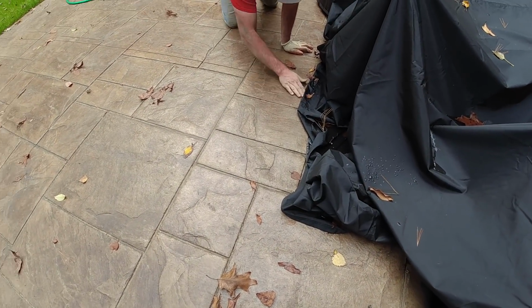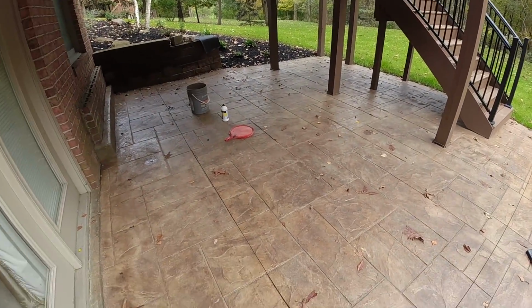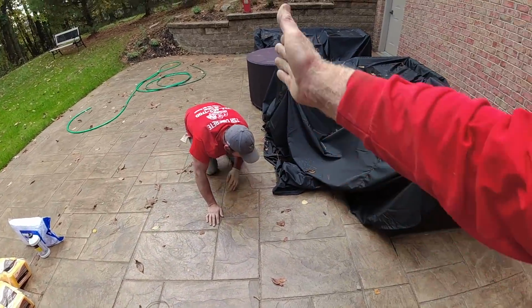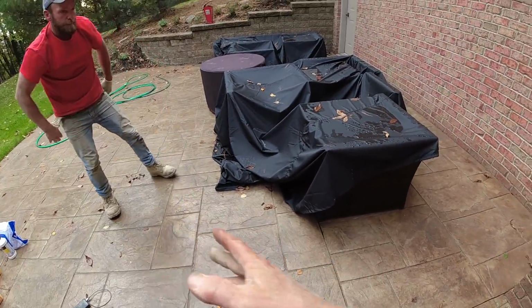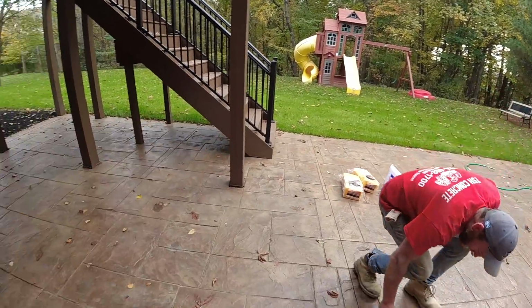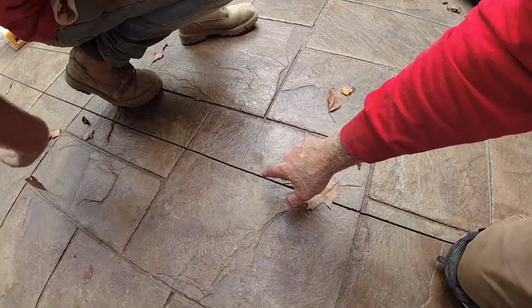We're on a patio repair. We did this about 9 months ago. And I always say concrete wants to crack in the center. In dead center, we have a hairline crack. Now I didn't cut it center because we have this bump out, we have deck posts. So I moved my cuts around a little bit, and sure enough, we got a crack almost dead center.